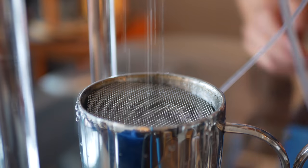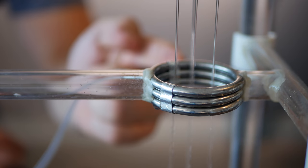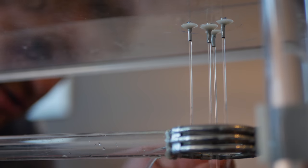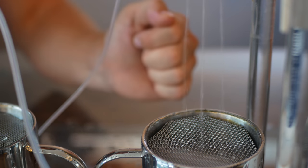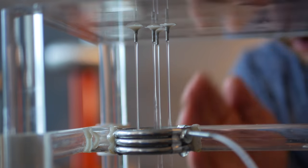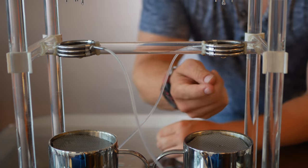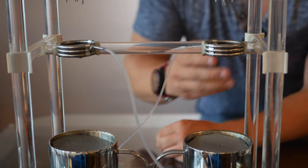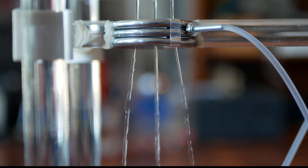Say the left stream has a few more negative ions in it. When that stream hits the collector, the collector now has a negative charge. But the right set of rings is electrically attached to the left collector, so it also experiences a slight negative charge — that repels electrons in the stream, pushing them up into the reservoir. This leaves the water with a positive charge, and when it hits the collector, it also has a positive charge. However, the left ring is electrically attached to the right collector, so it experiences a slight positive charge and pulls electrons down from the reservoir. So this water stream is more negative, depositing more negative charges in the original collector — making this more negative, more positive, more positive, more negative. It just keeps going and going, building and building. You can visually see this accumulation of charge as the water deflects outward, resetting with every spark. It's a literal cascading effect that starts with just a few stray charges through completely random chance.